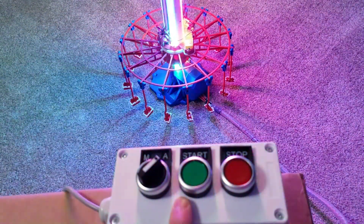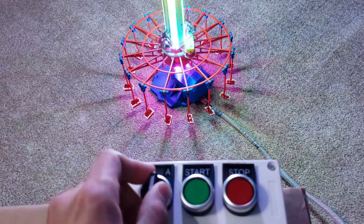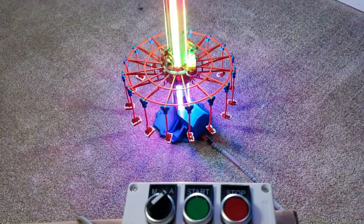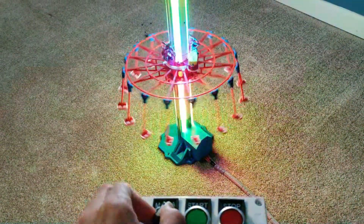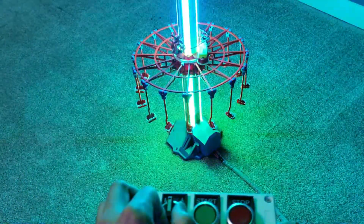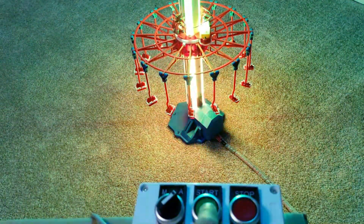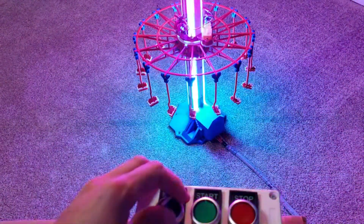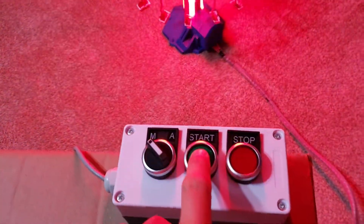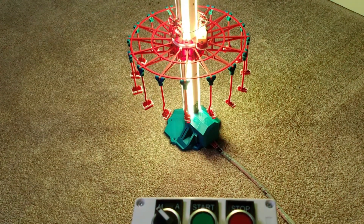Now I'm going to simulate an E-stop. Although I don't have an E-stop button, I programmed it so if you change the key switch during the ride cycle, it will actually simulate an E-stop. So I'm in auto mode, I'm going to start another cycle and simulate an E-stop right now. Both motors came to a stop and the ride is stuck where it's at — that simulates someone hitting the emergency stop button and everything coming to a stop. From here I can't just go back to automatic mode and start the ride. I actually have to get maintenance permissions to get the ride back to the ground. So I go to maintenance mode and hit ride start, which is going to raise it an inch and then go back down until it finds the home limit switch.